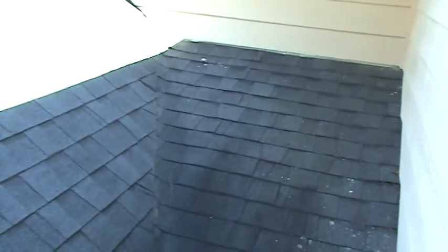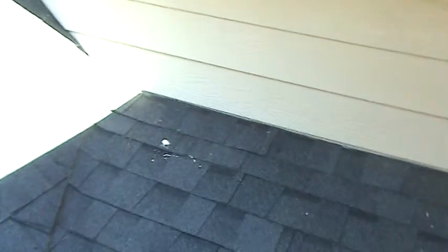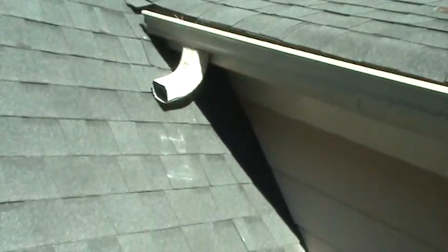And it's unbelievable to me that no one has talked to them about this. Everybody's talking to them about a new roof and 6-inch gutters and all those obvious things, right? But this right here, it's not a huge section. It's like 6 by 14 in here. All right, and we'll go up one more roof so you can see it better. But you've got a fifth of the roof dumps water into this little area.